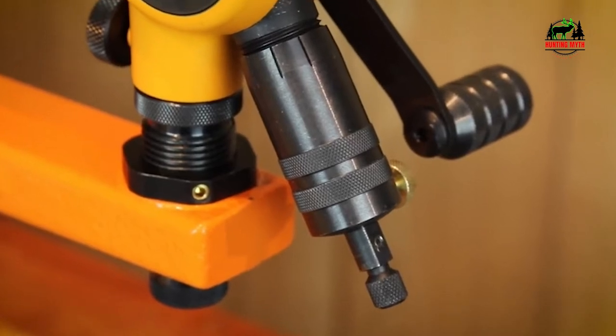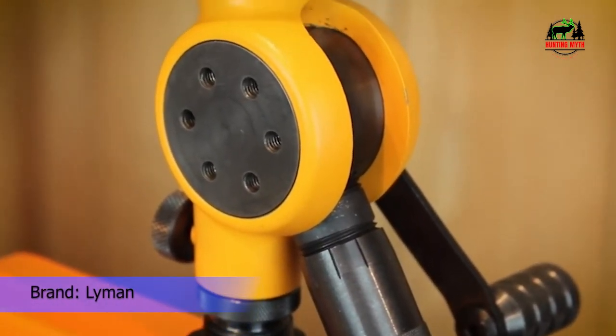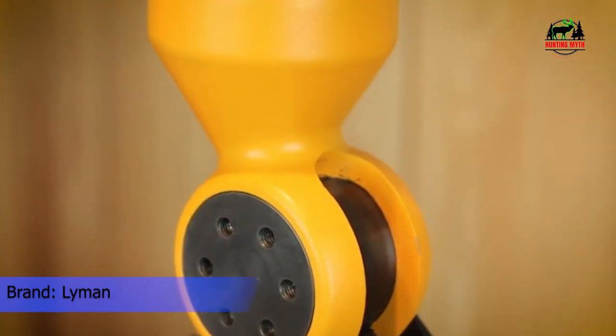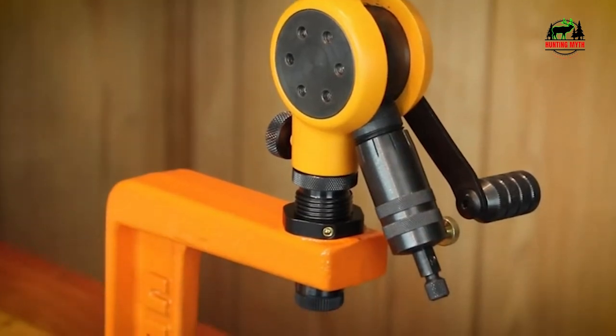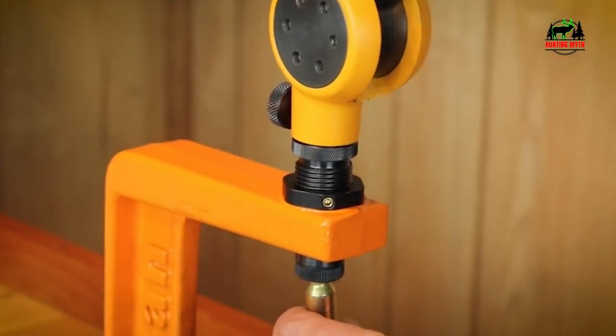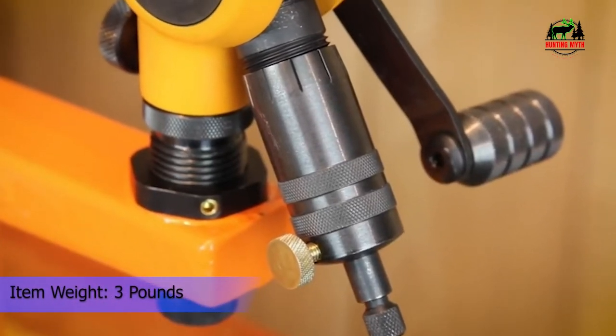The CNC machined steel metering cylinder features a micrometer adjustable thimble with reference lines, so resetting the measure is easy. The reservoir is equipped with a powder baffle, which maintains a consistent powder level for top accuracy, and includes 2 drop tubes to cover the full range of calibers.